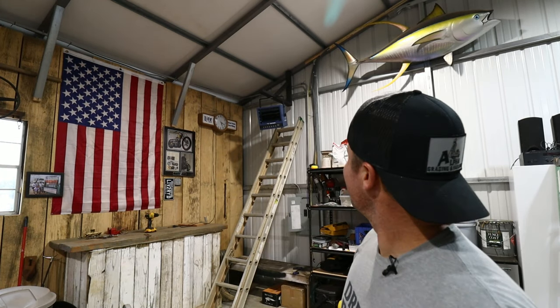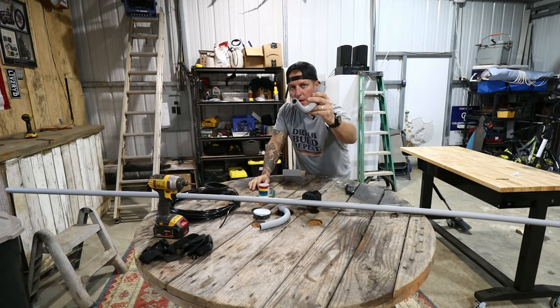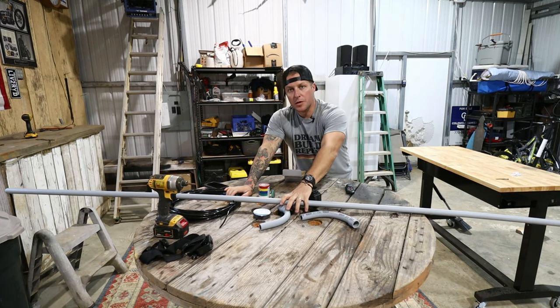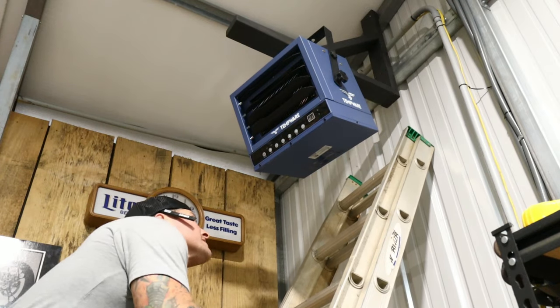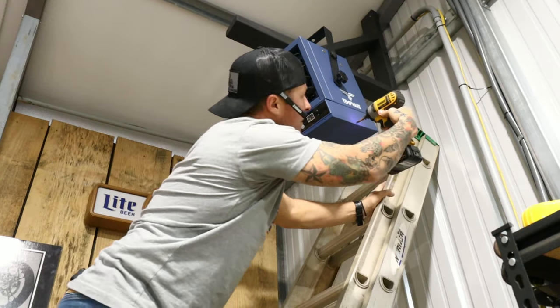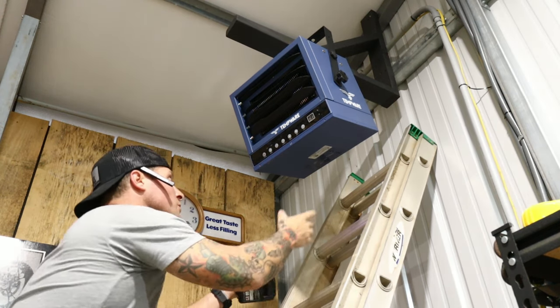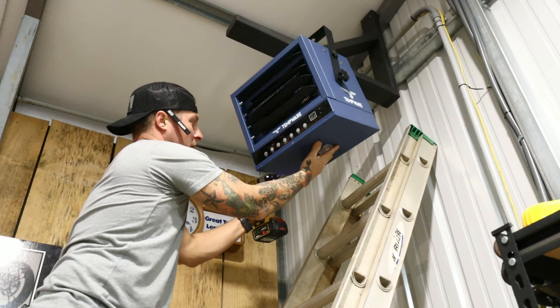I stepped back to see how it looks — it still looks tiny. God, that's a small heater, but 7,500 watts. Let's hope it works. Now we're on to the wiring. We're going to start at the unit and work our way down. We have three quarter inch conduit, a couple of 90s, a couple of straight pieces, and our wiring. Also, note to anyone doing this on their own: take your access panel off the bottom before you hang the unit up — it would be a lot easier than taking it off when it's hanging in the air.